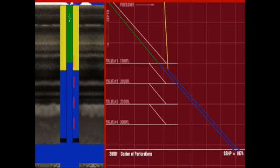Once the annular fluid is displaced to the second valve depth, injection gas begins entering the tubing from the second valve. The combined injection of both the first and second valves exceeds the throughput of the surface input choke, resulting in a casing pressure decline. This decline causes the top valve to close. Injection continues from the second valve as the well continues to unload, lifting both the displaced kill fluid and produced well fluids.